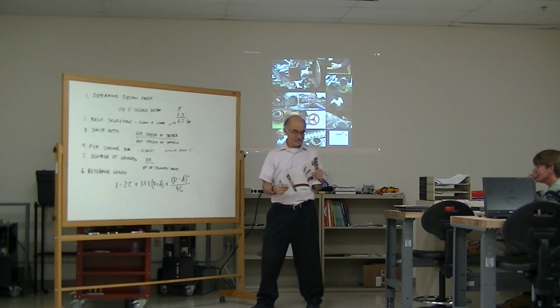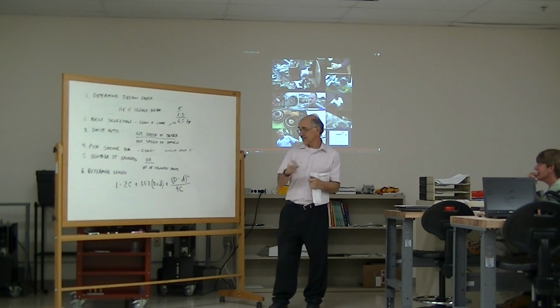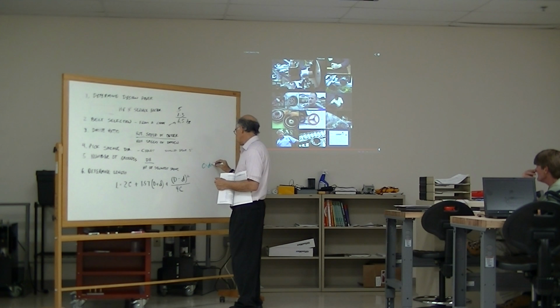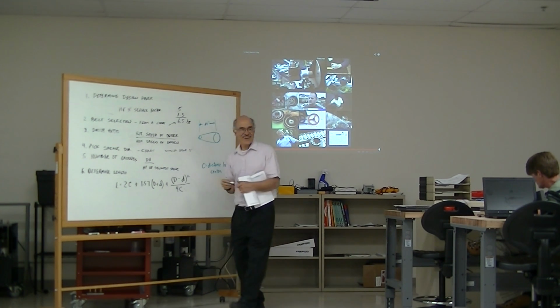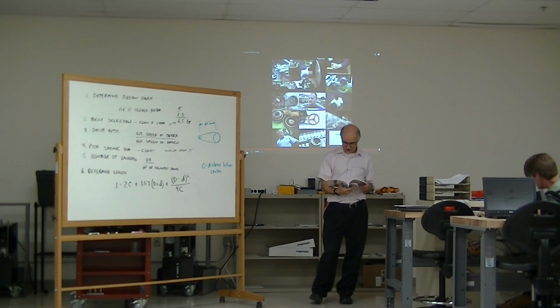Well, what do you think L is? Length? That's the length. What do you think C is? Center. Circumference? No, that'd be a good guess, but the C is the distance between the centers. So I have a sheave here, and I have a sheave out here, and the belt's got to go between those. Makes sense. Well, I better know how far those two are apart, right? I don't know how far those two are apart. I'm in big trouble. I got to know.